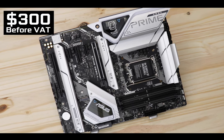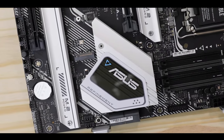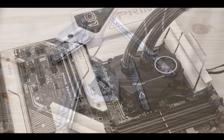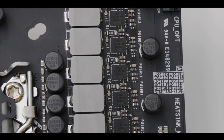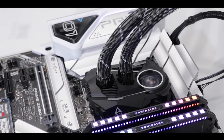In conclusion, at about $300 before taxes, the Prime Z690A has a $30 premium on its predecessor. It clearly benefited from a noticeable improvement in finish — better passive cooling components, a more coherent and pleasing aesthetics, and broad performance upgrades that clearly break from any Prime we've seen before. It is clearly a product of tranquil, quality, calm engineering, ready to age well. But unfortunately for the Prime Z690A, there is harsh competition. Despite having a lot going for itself, I feel ASUS missed the mark on a few points. The VRM, even though upgraded, falls below Alder Lake's abilities, and despite being able to squeeze 90% of its overclocking potential, the VRM will be the first limit of this build — not the CPU.